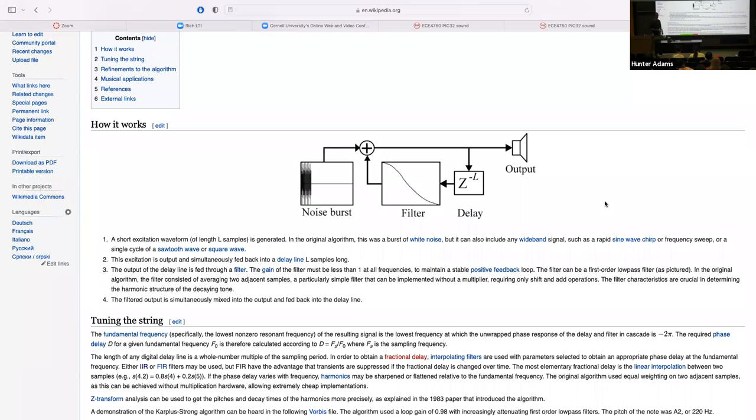How much extra time do we have for calculations before audio fidelity drops? The answer depends on the synthesis rate. In lab one we were synthesizing at 40 kHz. For telephone bandwidth you'd need about 8 kHz as a minimum for any kind of reasonable music; 16 kHz sounds a lot better, and 40 kHz sounds a little better still.